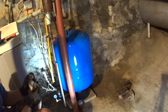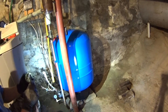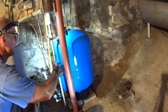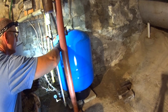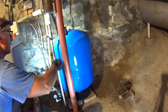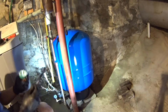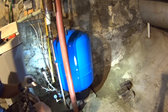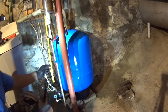That's half the fun, right? If you do it wrong, you always have a chance to do it over. We've got our paste flux — whatever you want to call it. We're using no-lead solder. The more you prep the joint, the better off you'll be — this is by far the most important step for soldering. This union doesn't have an O-ring seal; it's a copper-to-copper seal, so you don't have to worry about melting it.